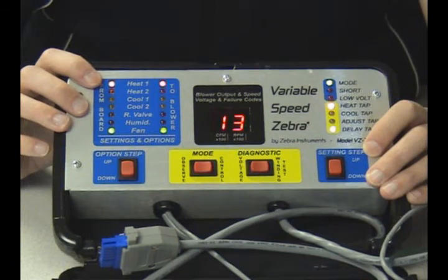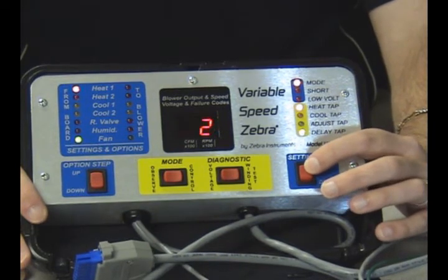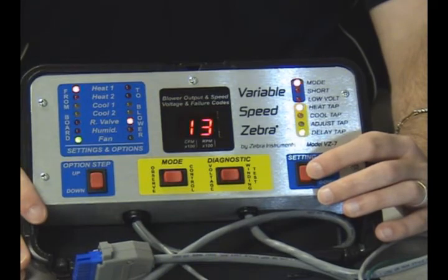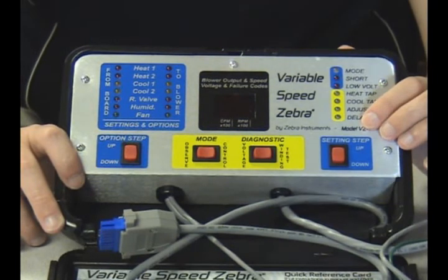Selecting any other output line in control mode will have no effect. The setting steps in control mode are 1, 2, 3, 4, and 5, but only 1 and 2 have any effect and they correspond to heat 1 and heat 2 LEDs respectively. There are no taps used on this motor type, so no tap LED will light. Occasionally there is a soft glow from one of the right-hand heat 1 or heat 2 LEDs — this is a slight feedback from the motor and should be ignored. Look for bright LEDs when examining signals in the observe mode.